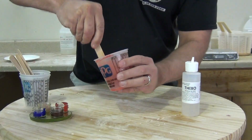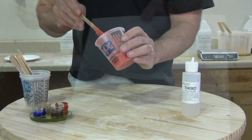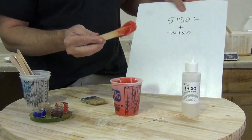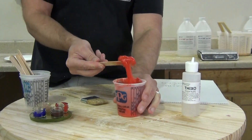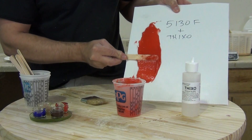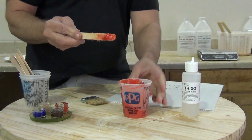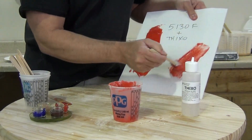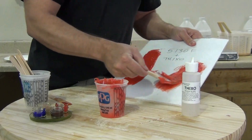It's really important to play around with the silicone — make a small batch like this and play around with it to see how it responds to thickener and what percentage is good for your applications. It's important to understand how the thickener reacts with the silicone so you know what to expect once everything's mixed up. That way, when you're troweling this onto a vertical surface or brushing it onto a pattern, you know exactly what to expect. You can start playing with using a very small amount of Thixo for a print coat and then building up to a really thick paste to fill deep undercuts. At the end of this video, I'll link to our skull video where we make a mold of a skull using the 5110 — a great simple glove mold technique that can be done over a variety of small patterns.